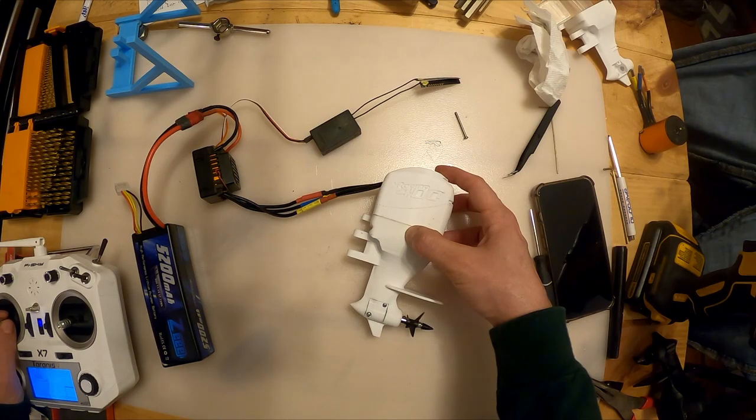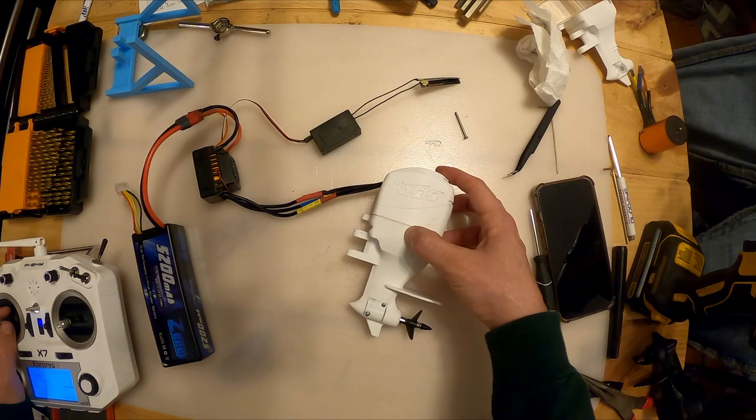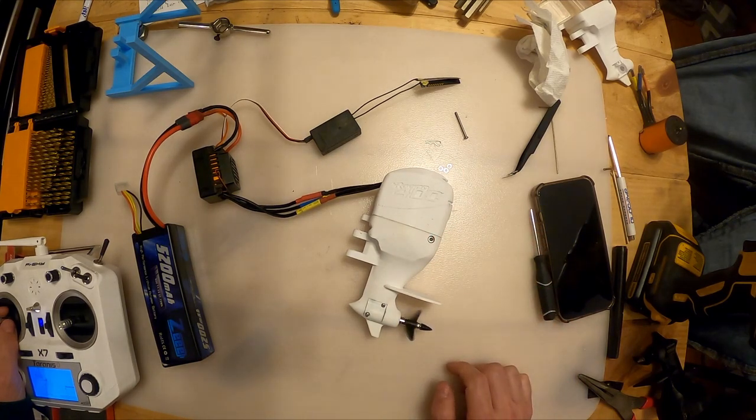Probably want to do some low speed sweeps, maybe 0 to 10% of throttle, up and down, check it out, make sure it's running in. And I can already tell this is getting smoother, just from listening to the frequency it's making. And look at the low speed RPM stability getting better. You can hear it's not hunting as much. It's starting to settle in, which is nice. All right, so I'm gonna rev it up a little bit more and let it hang out.